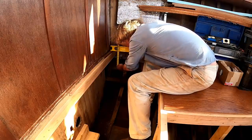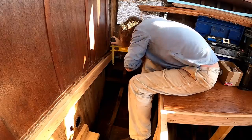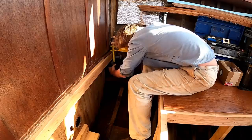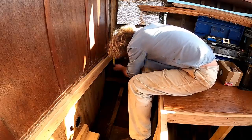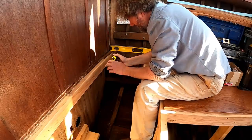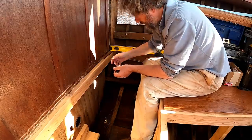So if I was to take the full 3 inches of this elbow, in other words, as it comes off the muffler, and slide it in like that, I would have roughly 7 inches drop from the four, that would mean 3 inches of slope between the engine and this point right here.